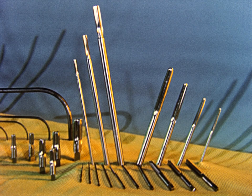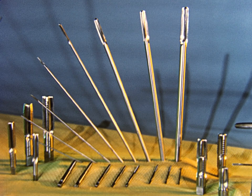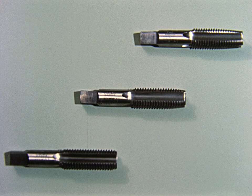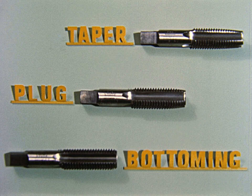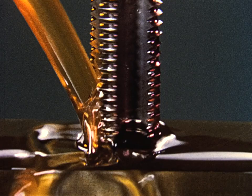The action of all taps is essentially the same, although the variety of taps available is almost endless. Let's look at some of the taps used most frequently for many different purposes. Because tapping was originally done by hand, the most commonly used taps were, and still are, called hand taps. There are three types: taper, plug, and bottoming. The taper tap has the longest chamfer, the bottoming tap the shortest. The plug tap is the most commonly used type. It is used for through holes or blind holes where depth of hole permits obtaining the desired length of full thread.